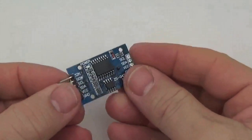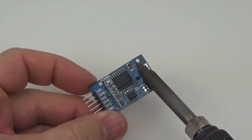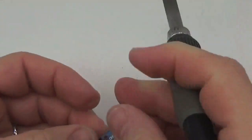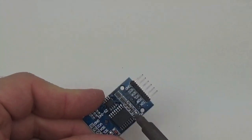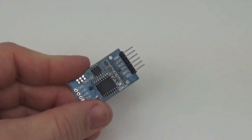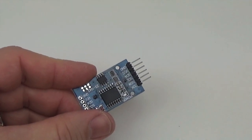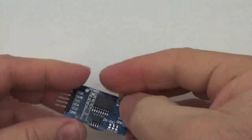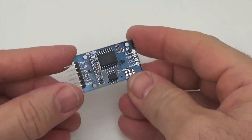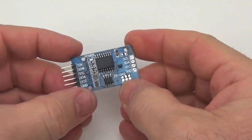Preparing the RTC board, again, just as I'm sure everyone's used to by now, we kick off a few unnecessary resistors. This is the charging circuit that we don't use, and this is the power LED, which just wastes power but does nothing. So this part could be done before you hand the components out to your students. Also the cleaning, again, I'm just going to zip past that here, but I clean these things pretty ruthlessly when I'm putting them together for something that's going to be deployed.